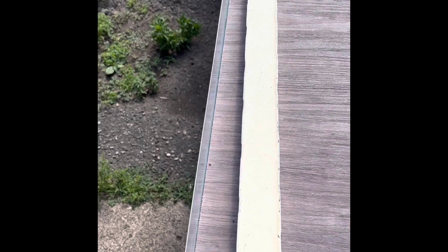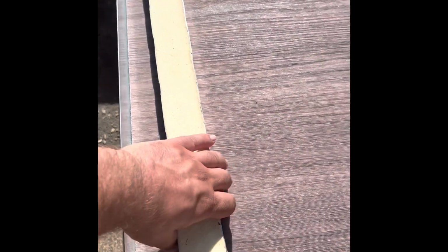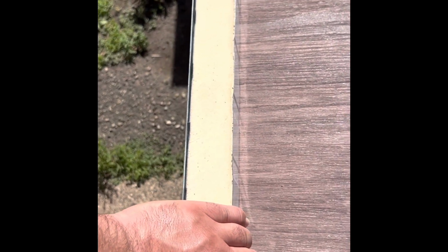And how I'm going to connect them is I have this galvanized piece I had bent up, and that's going to lay on top of the frame, and then my panels drop down on top of the frame inside. Well, these will actually get riveted to the main frame, then the panels get bonded down. Then I'll lip underneath this panel another L angle that will form a channel that these panels will drop down into, and then I'll rivet both the outside and inside. Over the top of the outside I'll have some diamond plate skirting that will cover this whole piece and make it look nice and fancy.